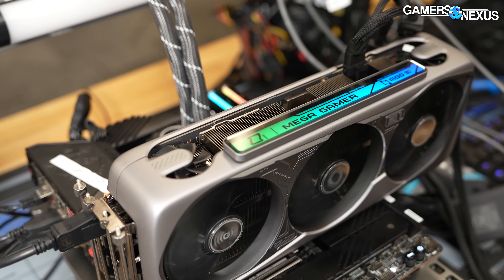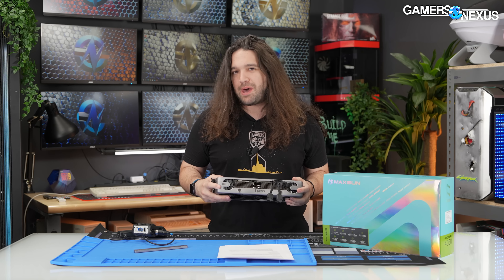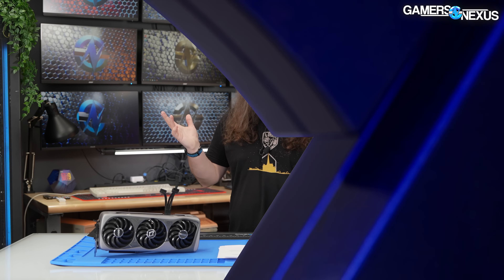Those top fans were adding 0.8 to 1.5 dBA of noise to the noise profile, which is not worth it — it's a worse noise profile as a result, with a higher frequency at that 2,000 to 2,700 RPM mark. The most positive aspect of this review is that it shows Maxsun is capable of building a quality video card cooler, even if this one is mostly gimmickry. So despite the top fans, the cooler is good enough that if another Maxsun card comes out that looks more legitimate, we'd be happy to look at it — because this is better overall build quality than we expected. It's a fun one to work on, not worth buying, but interesting nonetheless. Thank you for watching — subscribe for more, visit store.gamersnexus.net for mod mats and merch, or support us at patreon.com/gamersnexus.